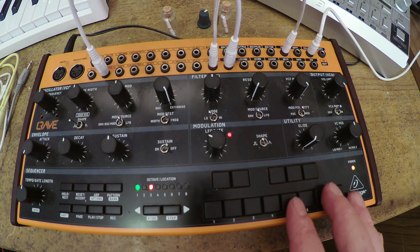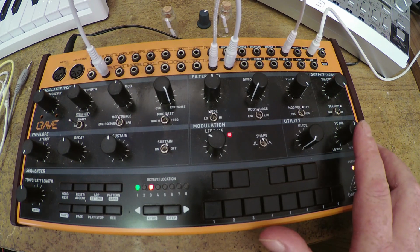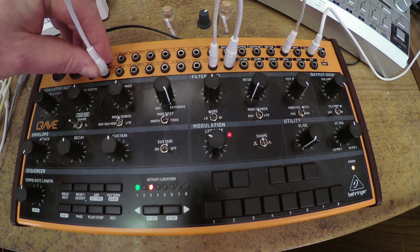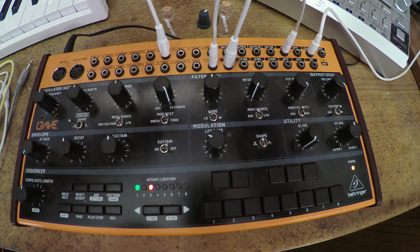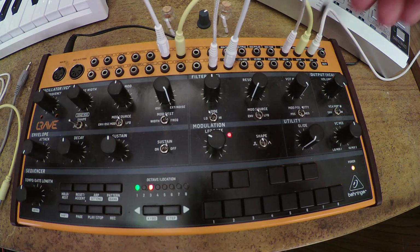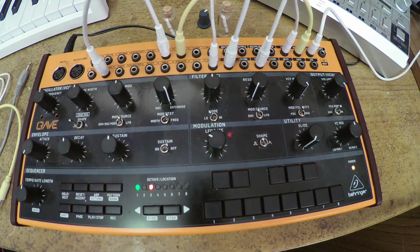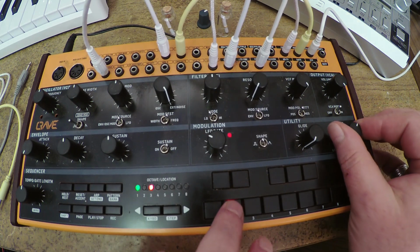We're going to make a snare drum using noise. To do this, we'll need to use the VC mix so we can hear the snare and the bass drums. We unplug the external audio and plug it into mix 1. Patch noise into mix 2. And then the VC mix into external audio. To the left is bass, and to the right will be snare.